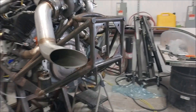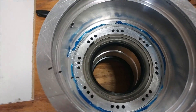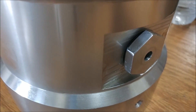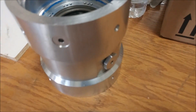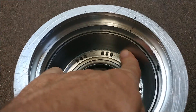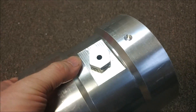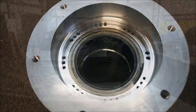Once it warmed up, the smoke was gone and it's actually fairly quiet — the turbos do a good job of silencing it. Back to the belt drive: the center section is all pressed in with bearing grease to help it slide in. There's a fitting where the oil transfers through for the governor control for the prop — it goes through there and through the shaft out to the governor. The main bearing housing is pressed in, and the next step is to fit the bearing and close it out so the shaft can go through.